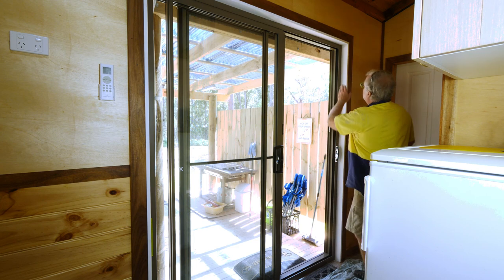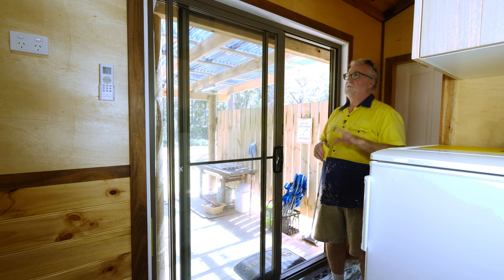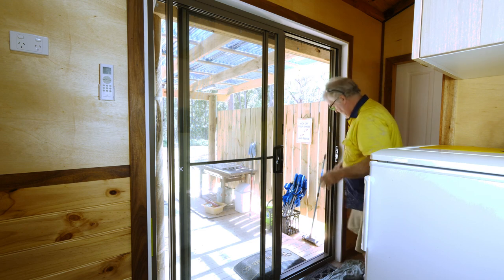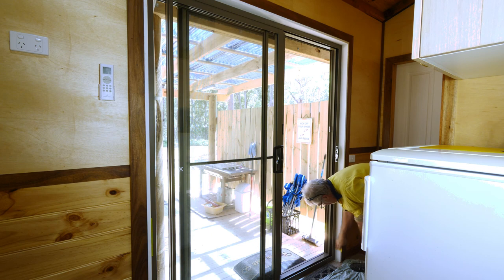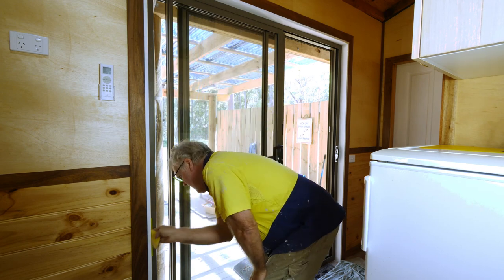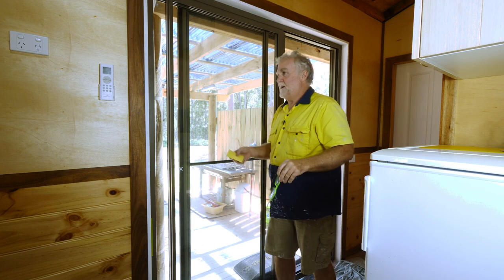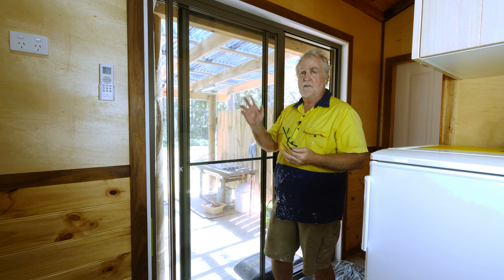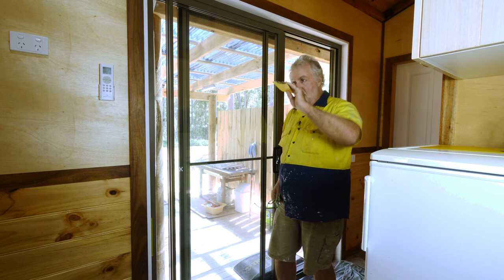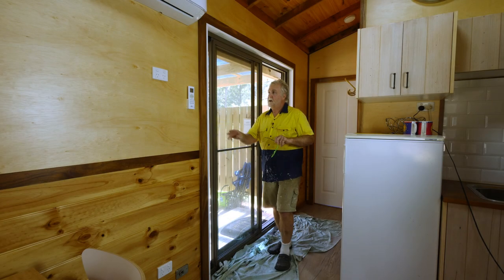I realize you can't see the six holes I've patched here. Just like inside, I've done it twice and now it's all about sanding. Just time how long this takes me to do six little spots... Not even a minute of sanding. I can't tell you how long it would take if you overfill — it would take you many times longer to get that mounded bit of patch down to flat. So I'm going to paint this now.